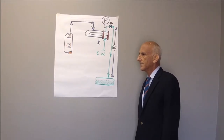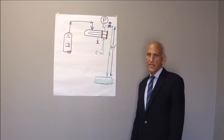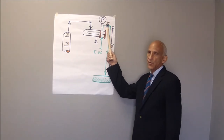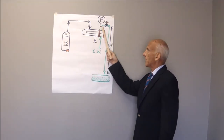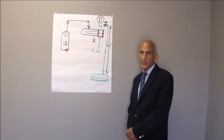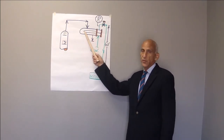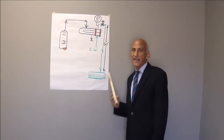Should I always keep the water outlet valve on the water cooler wide open to maximize cooling water flow? Actually, not necessarily so. A lot of our condensers are elevated well above the cooling water return header, so that if you open up this valve 100%, the pressure at P1 falls well below atmospheric pressure. Then, the air that's dissolved in the cooling water, especially if it's seawater, will flash out of solution. As the air flashes out of solution, the volumetric flow through the tubes and exchangers increases, which increases the pressure drop of the cooling water flowing through the tubes, and that has a tendency to choke off the flow.